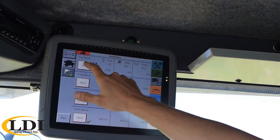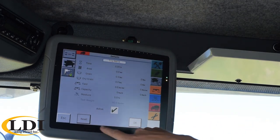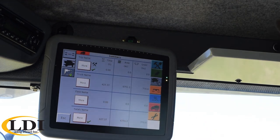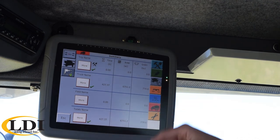The next one is just kind of a set of counters. Now this doesn't really tie into your main yield mapping per se, but it allows you to record some yield data. Let's say you wanted to record how long it took you to harvest a field, how many bushels you pulled off of it, and how many acres it was. You come in here, you can name it anything you want, and then you'd hit reset so that it starts fresh, and make sure the box is checked for active. Once you have that going, it will allow you to record that data. You can have multiple ones running at the same time — so one running per field and another one running for your full harvest.